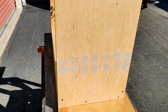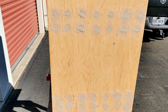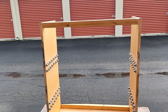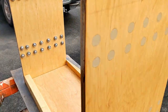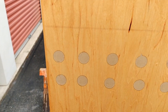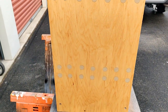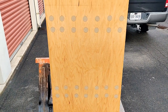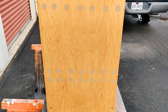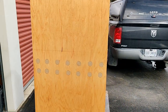It acts more like a paste — kind of like a glue — which really helps hold those bolts in place even with the nut on the other side. I've now cut off all the excess bolt ends and sanded everything down — hit it with 100 grit and then 220. The filler doesn't take stain the same way wood does, so it'll be a little gray, but that's fine since this is literally inside the cupboard. The filler is like a bondo — incredible hold and very easy to sand. It came out really nice.